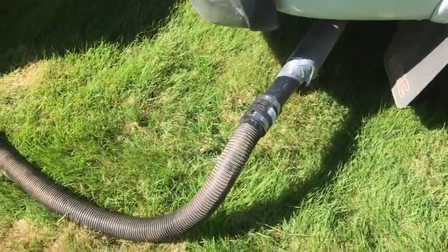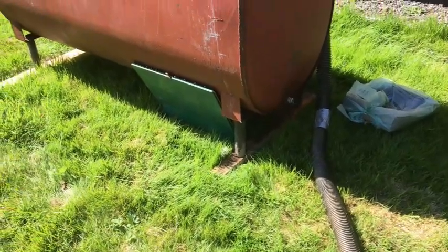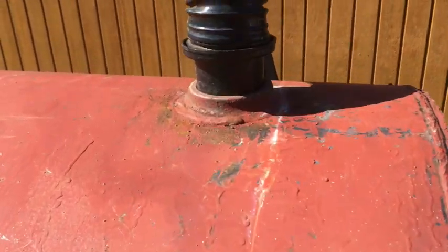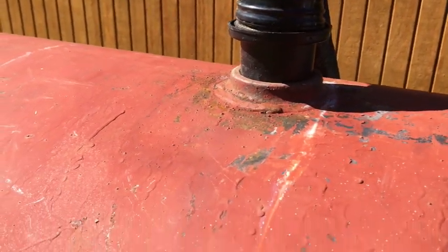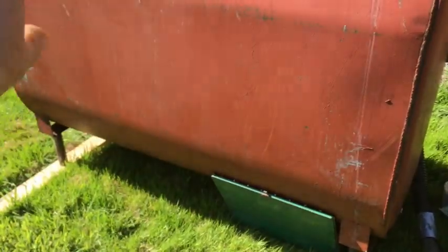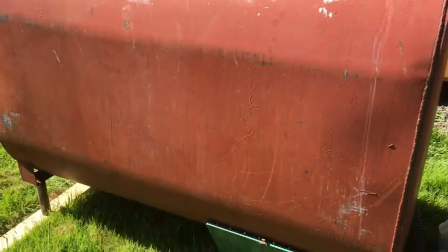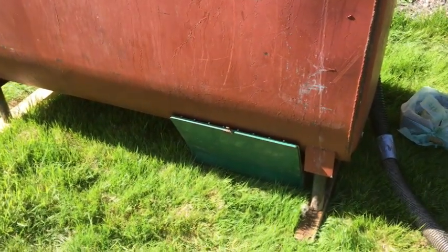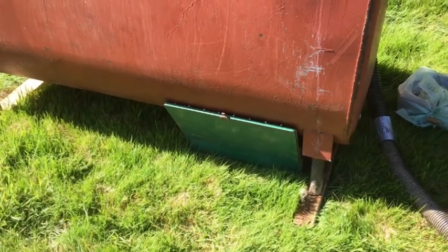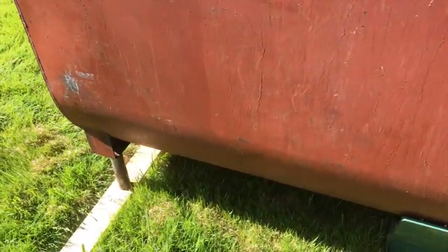Okay guys, this is after I have rinsed out the residual from the second acid wash. I have the exhaust from the truck going in here, pushing warm air into the tank, and just circulating the warm air from the exhaust through there. I've got the sun working for me today, and I also put a camp stove underneath there and lit it so the puddle would dry out a little faster. So I got a lot of things going on here.